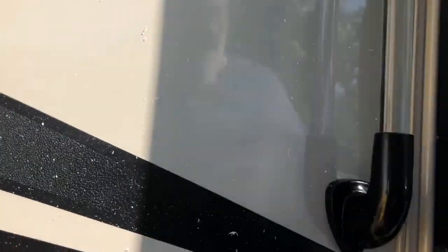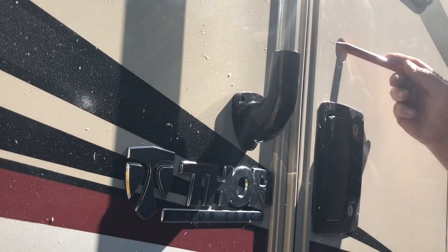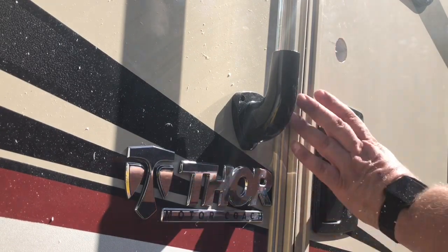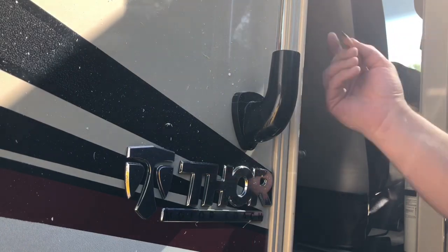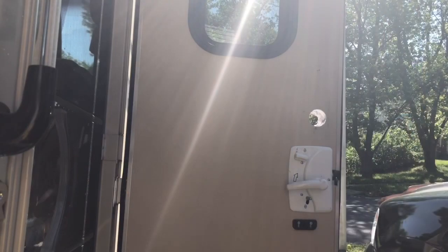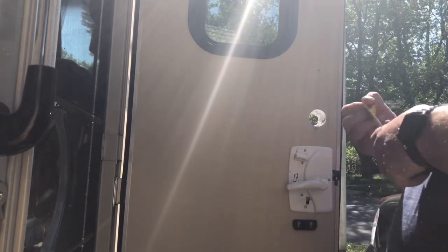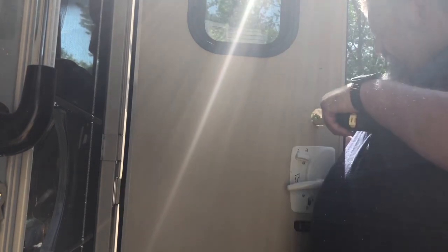I tested the inner plate and it fits on the door well. Everything looks good. I shut it and take a pencil to mark the door jamb to get a rough estimate of where I'll be drilling a hole, even though I won't actually drill it until after the deadbolt is installed. The door is real flimsy, so if you try to put the lock on it's just going to crush — I'm going to make the sleeve that you need. I measure and it's about one and a half inches thick.